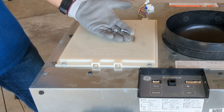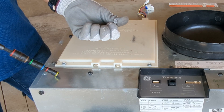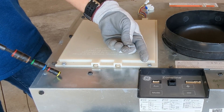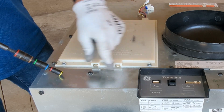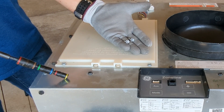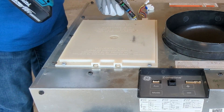You may have noticed in the video there are different types of screws. The gray screws with a coarse thread go into plastic. Any of the black screws go into sheet metal. So if you get a bunch of screws loose and you're not sure which goes where, that's a good indicator of which screw goes to which area.